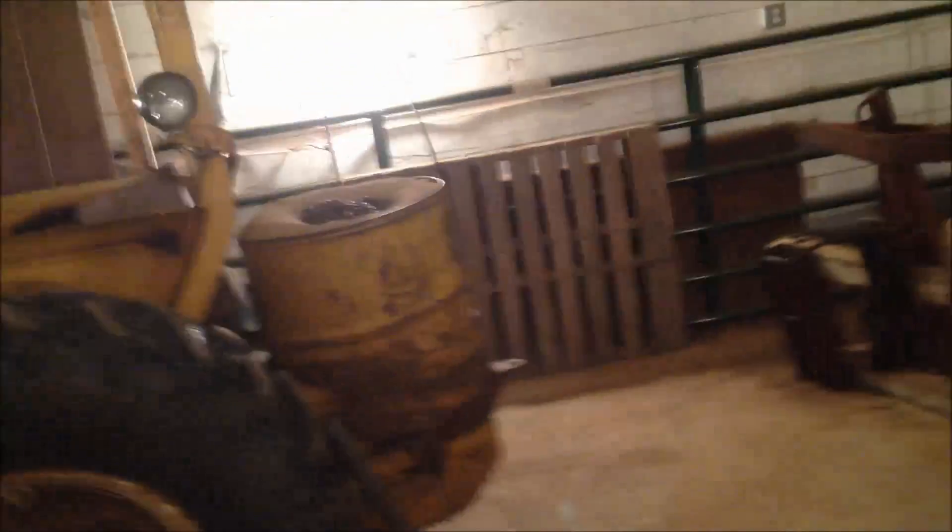I did the best I could to bend it to a little bit of an angle to match the curvature of the rim. I had a piece of one-by-one by eighth-inch and you can see what I did to it — bent it pretty easily — so I scrapped that idea and went to a bigger size tubing with a thicker wall and it worked beautifully.